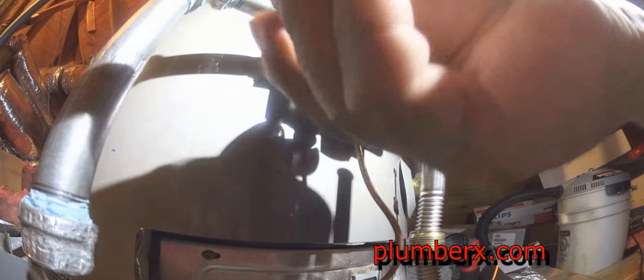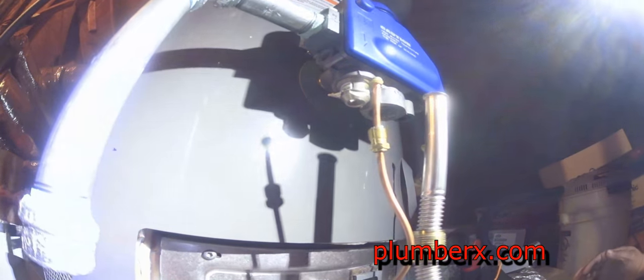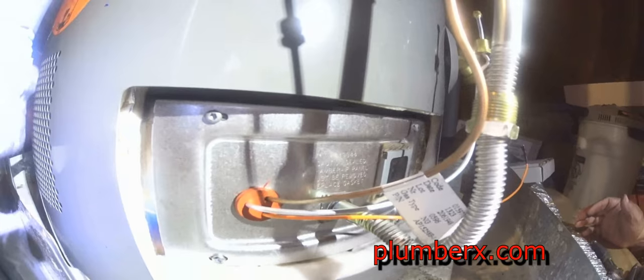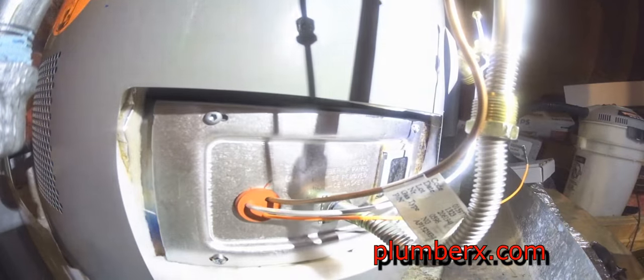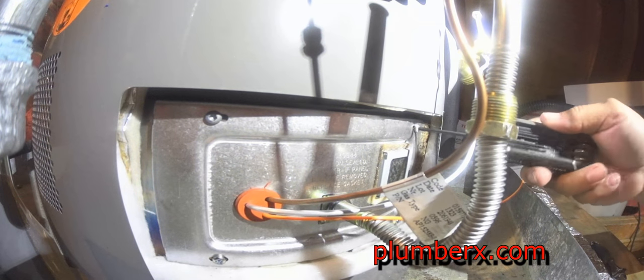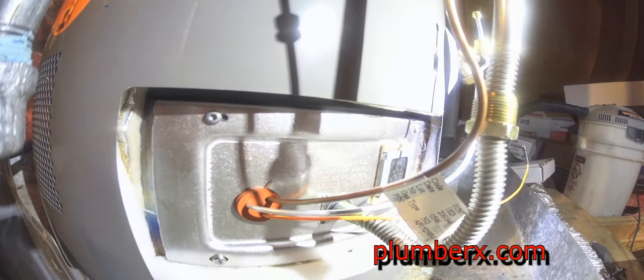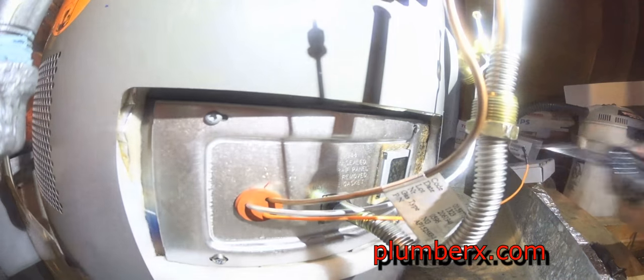So I did go over there to give him a hand, and it so happened the supply house gave him the parts that he needed, but he didn't realize that the little glass tubing that held a little oil in it was the problem. When that little glass tube pops, it holds the device in place. Once it's popped, it releases that device, and that device shuts down the water heater.